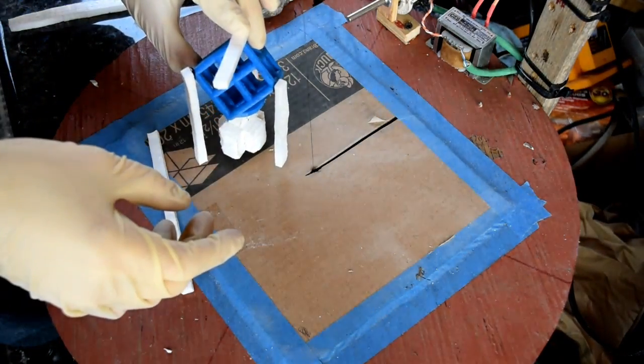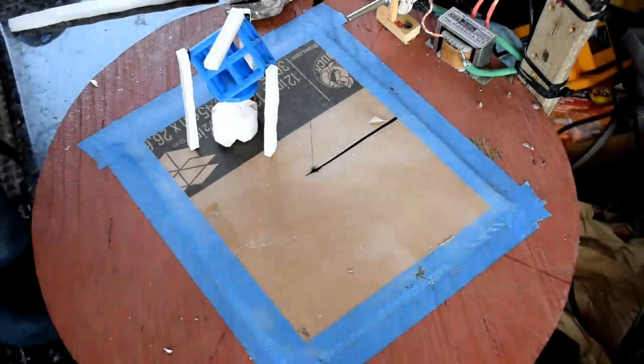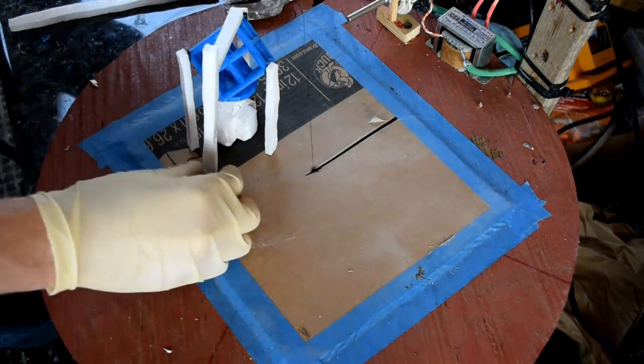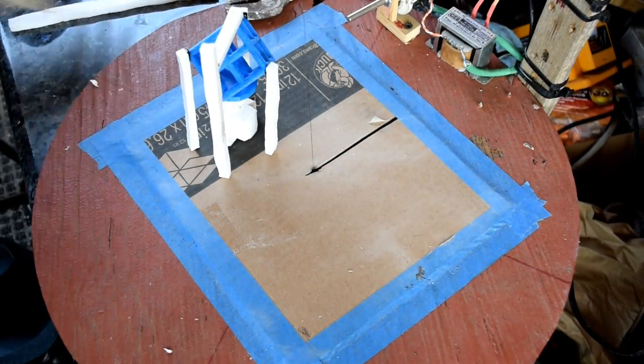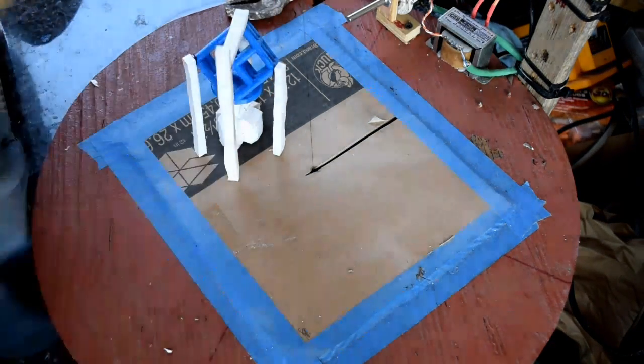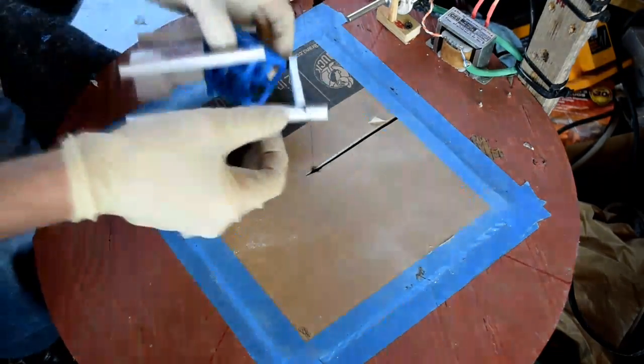I then went to a hot wire cutter and cut the main sprue. I aired on the side of a lot of vents — I did a total of 4 risers: one from the very bottom going up and 3 on each of the outside corners. In actuality I probably should have done more, and that probably would have helped the fill as you'll see later in the video. But all in all it turned out fairly good.